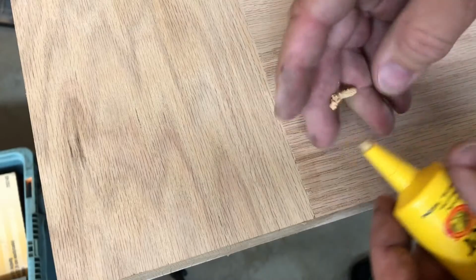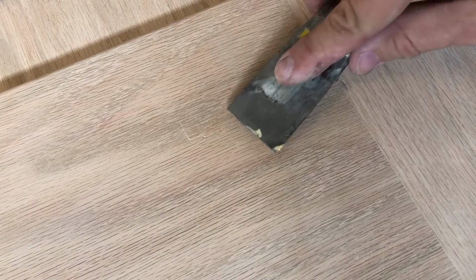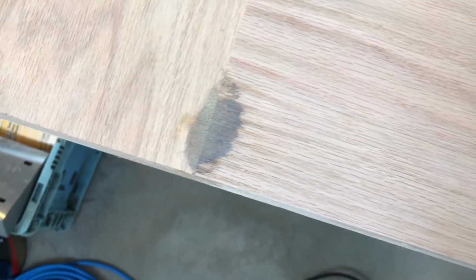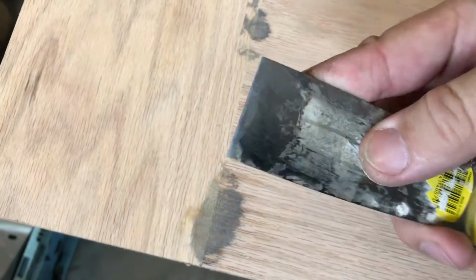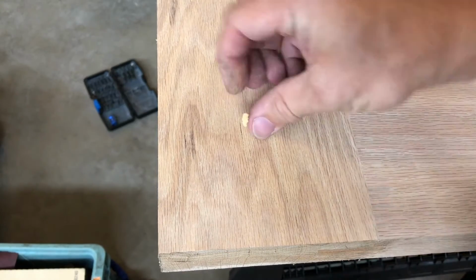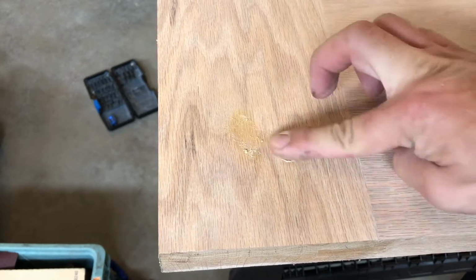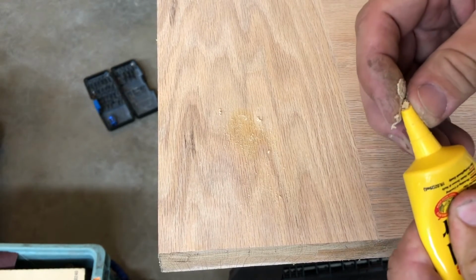Visible areas of the door are filled with stainable wood filler. For some reason, when applied with a spackle tool, this filler turns dark in color. Must be something that reacts with the metal. I used a non-metallic spackling tool from then on.